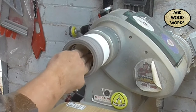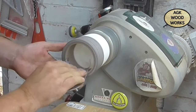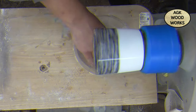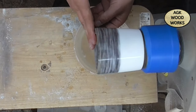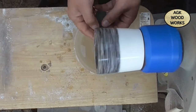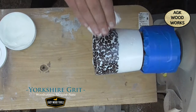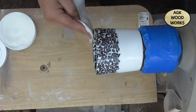So now I'm using Klingspor abrasives sandpaper, and I am starting from 120 grit and I do go up to 400. Then I wet sand again — as I've said before, I sand from 400 wet up to 1000 in wet sanding — and then I use the Yorkshire Grit original. I thought I'd just cut that bit out on this one and jump straight into the micromesh.